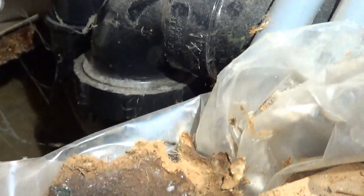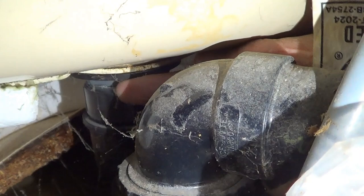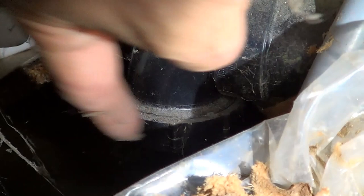If we look even closer we can see that drain right there. The thing we're going to be looking to get off is this piece right here — that silver piece is the drain. This is a swivel nut that we can use to unscrew that and get the drain off, then the tub will come right out. If that doesn't loosen up at all, we can then get the nut right here off of the P-trap.